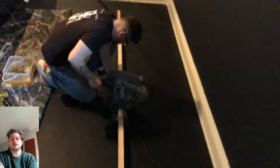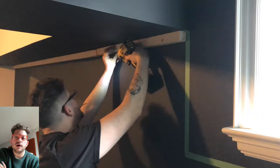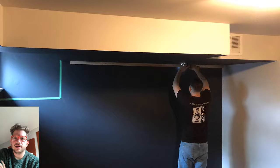These 2x2s make up the exterior framing of the wall — this is what's going to contain our one-and-a-half-inch thick acoustic insulation. The final dimension of the 2x2 is one and a half inches as well. On the front wall I'm marking out stud locations and getting my exterior frame where I want the wall to end, framed out in the 2x2.